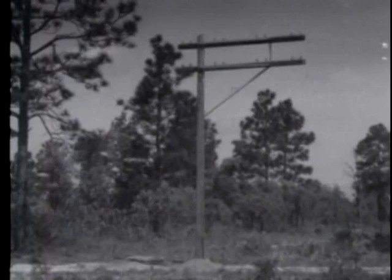Here is a two cross arm pole set in position. Notice that it has both back bracing and vertical bracing. Where more than one cross arm using back bracing is placed on a pole, install vertical braces between the cross arms. The vertical brace is attached to the side opposite the back brace. Notice that the inner bolts of the back braces are used to fix the vertical brace in position.